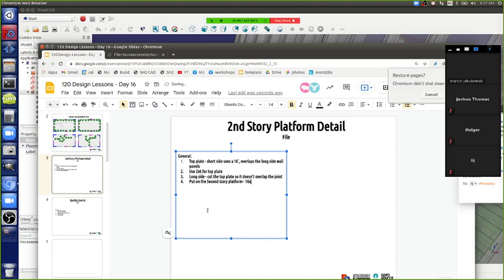So 16 by 32, nice and regular. At this point we've got to keep the house square, so the main consideration is how do you keep it all square? When we lay the wall modules up, the corners are measured to be pretty exact, within a quarter inch or so. If we lay them and end up at the very end of the corners, we are at the right length. We push in, and at the top we measure it and make sure it's 16 by 32 as well.